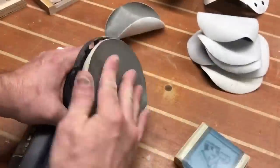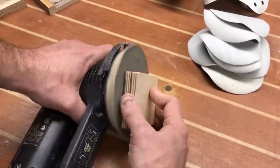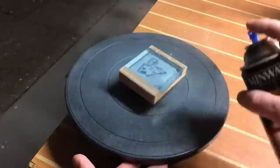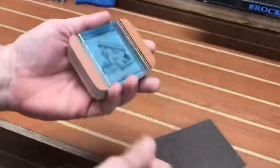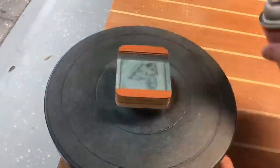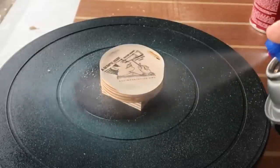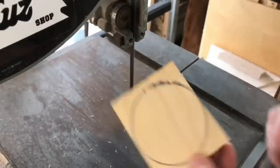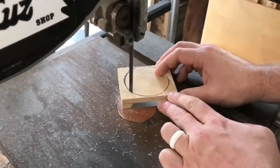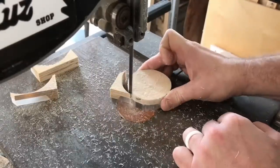Over the next few moments you'll see me cutting, trimming, and sanding these to various different designs. There is a micro mesh system that you can attach to your orbital sander which really brings out a nice sheen and clarity in the epoxy at the final stage. With the teak and holly plywood variety I tried to leave most of the wood intact to give it a nice color break. I'm using polyurethane clear gloss for the finish, but you can use spray lacquer, shellac — whatever you want.